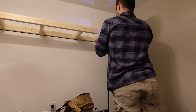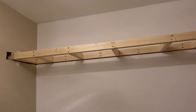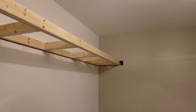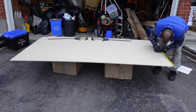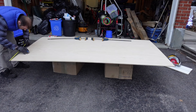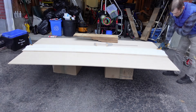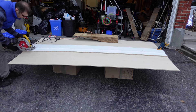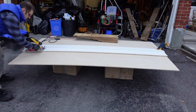Having that washer-type head really pulls the boards together very firmly. Once this is all screwed up, the framing that my shelf is going to sit on is very strong, and I have no concerns about putting a great deal of weight up on this shelf. You can see I probably cut out a little bit too much drywall, but that's not a big deal because I'm going to put the shelf out a little bit further. I actually take another two by three and screw it right onto the front as well, so that ends up being a double two by three up front. For the shelf itself, I'm using half-inch maple plywood. I just have a cutting jig I made up because I don't have a table saw setup that's good for doing full sheets of plywood — I'll throw a link in the description on how I made this. Then I just take the circular saw and cut it out.